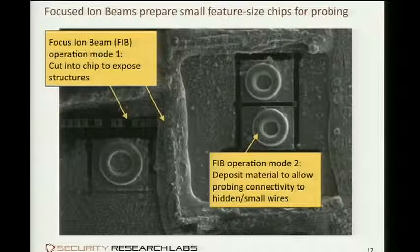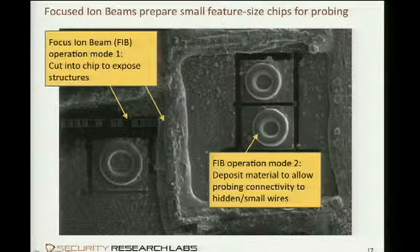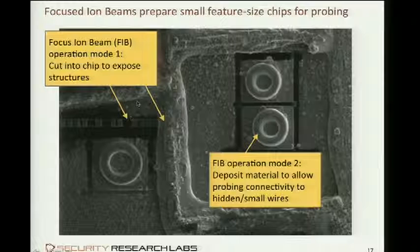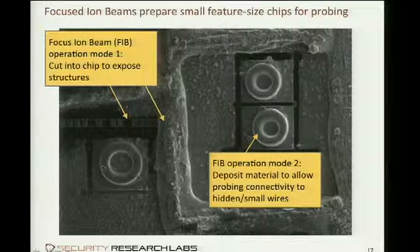So what has been done here, and this was done by Kristanovsky of FlyLogic, is he milled in these big boxes, and then built in a few more holes to see where on the chip he is exactly. For instance, this is a small cut that looks deeper down and sees the actual metal wires that are running probably 2 layers down from where he started. And one of these metal wires he was most interested in, I think it's this one, and he drilled right over here a small hole with the same technique, shooting ions and drilling down all the way to the metal. And this is similar to what the laser achieved earlier, but this hole is so tiny you can't possibly stick a needle in. So then he started throwing platinum at it and filled the hole with platinum, so it's conductive with the metal underneath. And to make it even more convenient for the needle, he built this little ring, again of platinum. So if you stick in a needle anywhere in this ring, it should connect to the metal underneath.